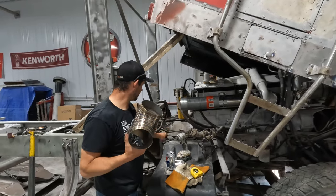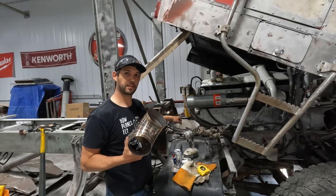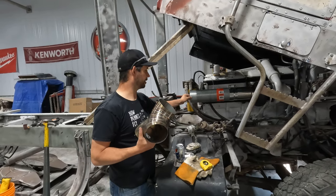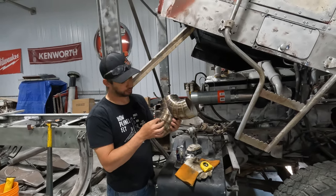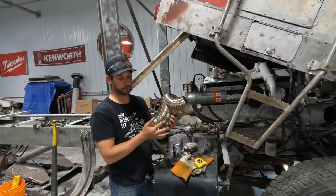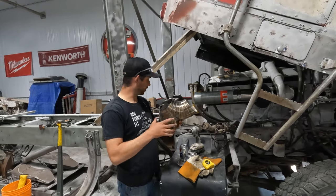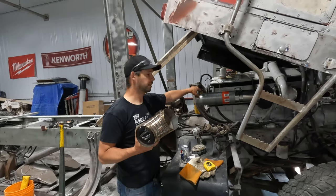So off of here, this part of your frame, and then the other part of the frame, I'm gonna build some supports. So I'm thinking, yeah, that's a lot of weight. We can't have that much, especially with this flex pipe. So it's gonna be supported right off of the Y branch. I'll do a little fish plate, and then I'll weld right to that. And then that way I'll make it so it all bolts off. So basically it'll be two bolts and a clamp.